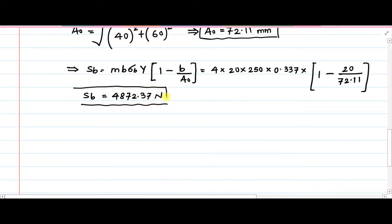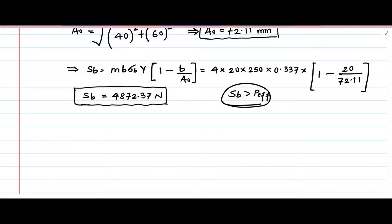So now we have the beam strength, but we still do not have the P effective, and that's why I wrote down this basic equation first, that this should be our focal point. So we still do not have anything about the P effective, that we will proceed in that direction very soon. Now we can calculate the wear strength.